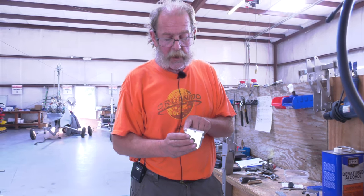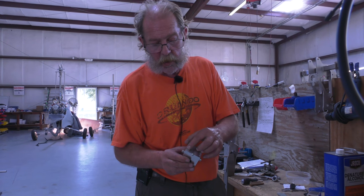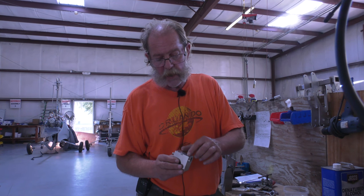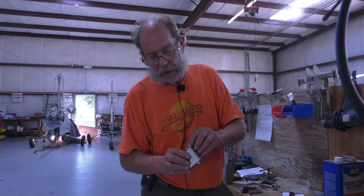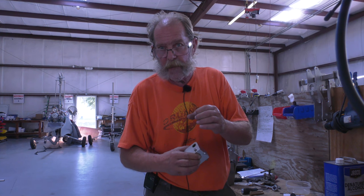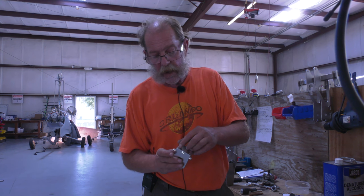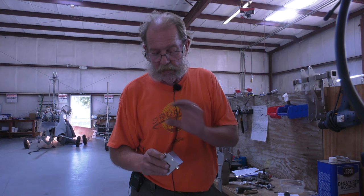This is the stop for the pitch — up and down stop. It has two set screws in here. The thread is a little bit tricky; it's a 5-40 thread. I set one in position, then I drill the other one. The hole goes through the rolling pitch block, and I drill into the stop pin to make a physical lock so the pin cannot escape. Then I run the set screw in with Loctite. So there should be no escape for this pin.